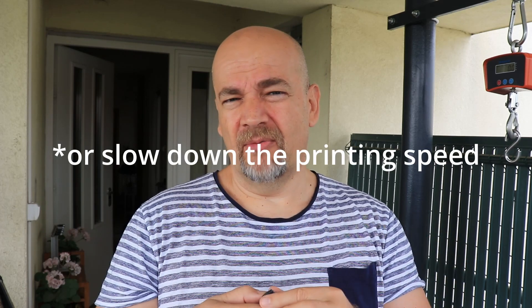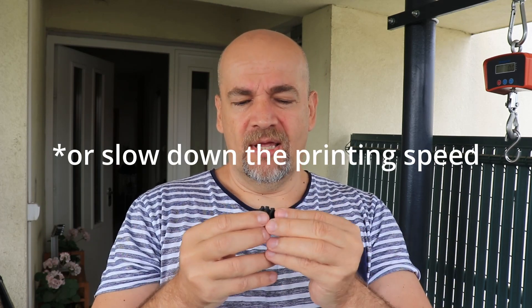Our short conclusion is that the numbers tell you everything — definitely, if possible, you should completely turn off the part cooling fan. Pay attention that if you have big overhangs or bridging, at least 10 to 15% part cooling fan would be recommended, but definitely without the part cooling fan the layer adhesion is much better.